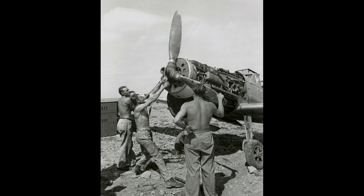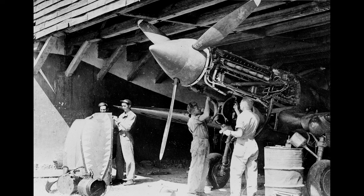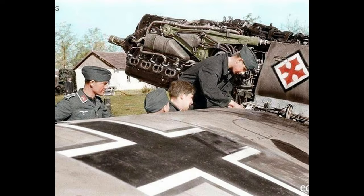Imagine you're working on the eastern front sometime in 1941 while it's raining or snowing. Imagine you have to change the spark plugs on a P-40 — you're going to need a ladder, and you'll need to keep getting on and off that ladder to move it as you work your way around all 12 cylinders. Every time you drop a tool, or worse a nut or bolt — and you car guys know what I'm talking about — it's going to get stuck somewhere in the engine, and fishing it out will take time. Oh, and you're probably doing this at night. The 109 mechanic can do all of this with his feet on the ground, and if he drops something, it's far more likely to hit the ground rather than get stuck in the bowels of the engine. Plus, he doesn't need to go up and down a ladder every time he needs another tool, drops something, or just needs to move to another part of the engine. I think that from this perspective, the inverted design is a big help in actual frontline operations.